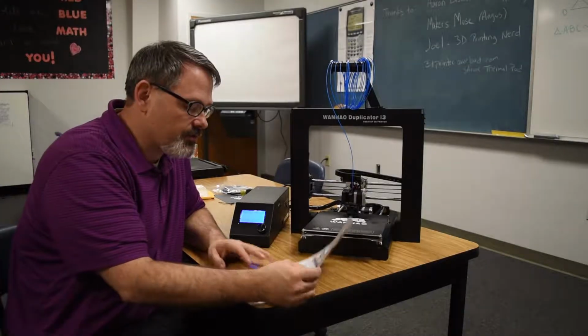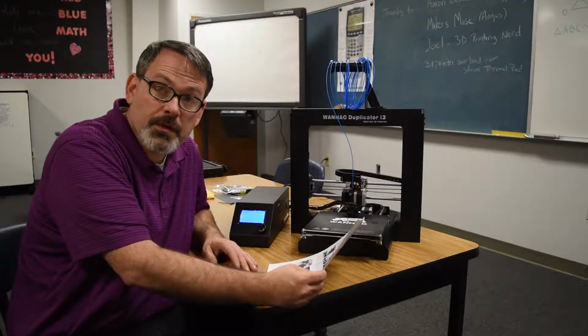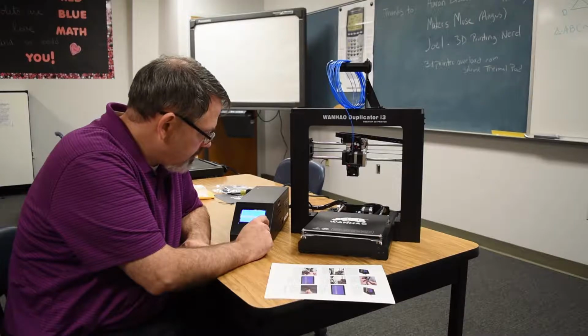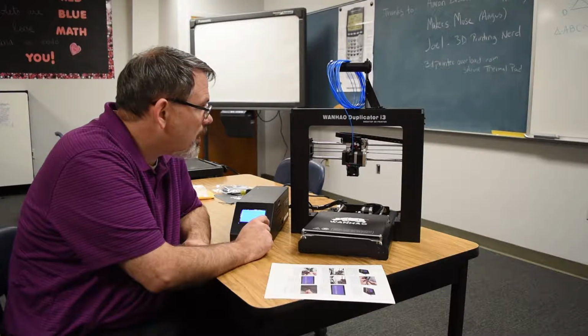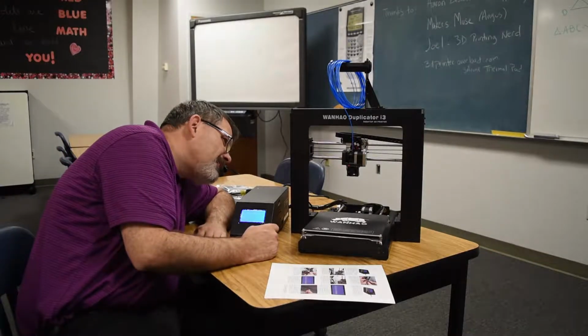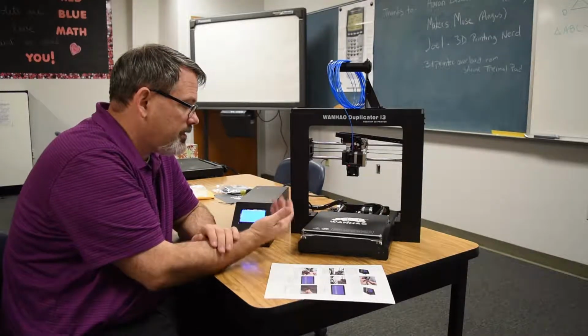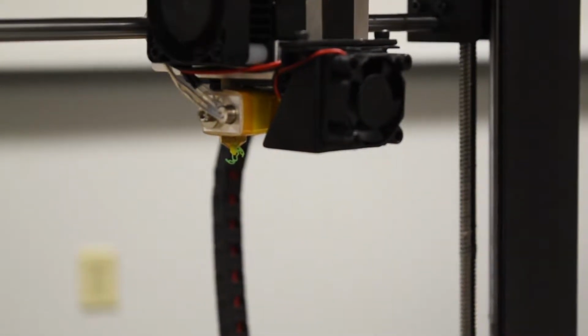It seems to me that I must have missed a step, because the extruder is supposed to be up and not down touching. Now I'm going to go back to extruder position and see if I can get about, it says 2 inches. It also looks like the extruder nozzle is not over the plate. The plate is forward of the nozzle, so I really need the Y position to move back. I assume touching it is not advisable.